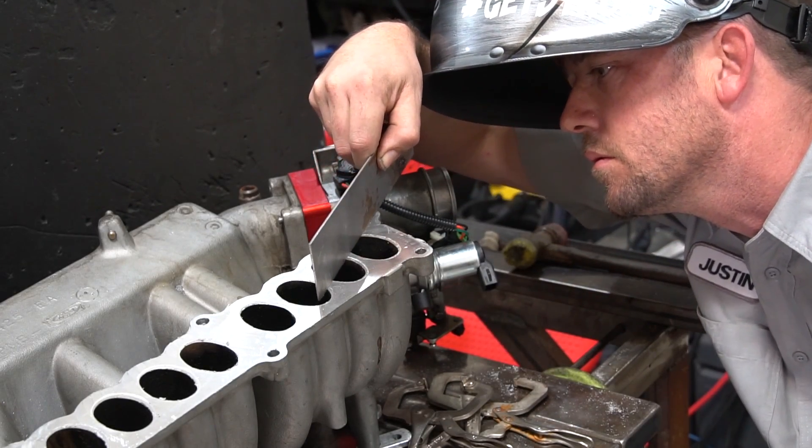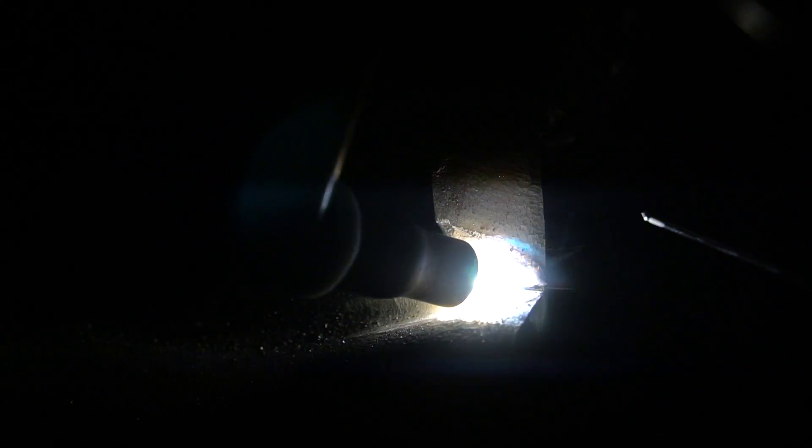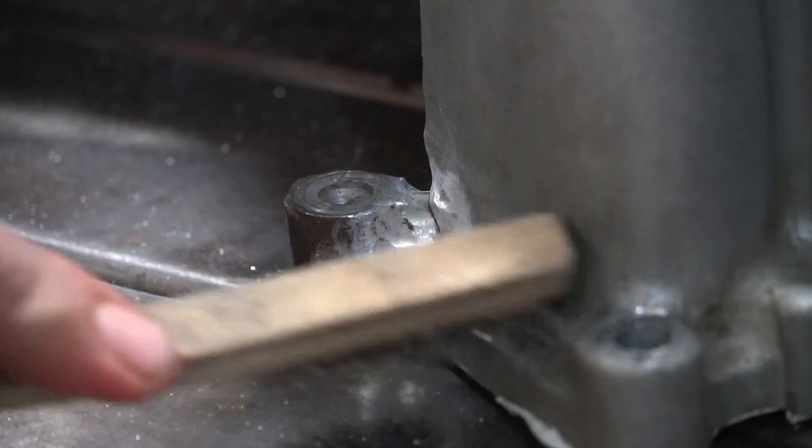Some of these shots are a little bit difficult to gather, but they're pretty clear anyway. We're just adding a little bit of filler metal and chasing out any kind of impurities, any kind of porosity, any kind of imperfection. The more time you spend hammering down on it, the more it allows stuff to come up and break through that surface. Whether it's a pocket of air or some junk from the metal, you're feathering in and out of the pedal and pushing that junk to the top so it finally gets out of there and good fresh metal can be deposited. We're essentially doing nothing more than displacing crappy metal with good metal. Kind of light in the beginning — we want to clean up all the areas around it. Running around with the arc blasts out some of that junk and brings it to the surface. The more we hammer down with heavy amperage and add new filler, we continuously displace the old stuff with the new stuff — essentially building a bridge right over the top of it.